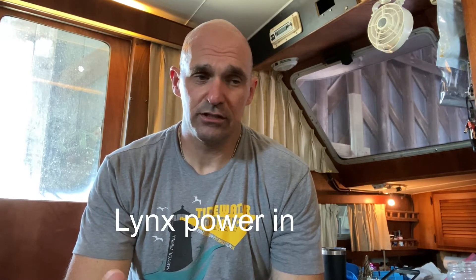I've got four 105 amp-hour 12-volt batteries. They'll be split into two 24-volt 105 amp-hour banks that'll lead into the Lynx distributor. The shunt and the power-in are all mounted already. I also mounted the brackets for the Multi Plus inverter and the isolation transformer. The space is really tight, so I'm not able to videotape all the different pieces, so I'll give you some snippets.